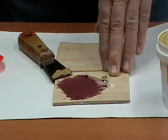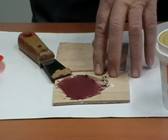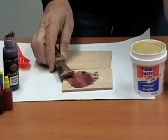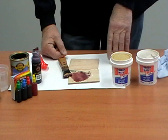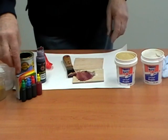There are two ways I can work with this. I've made a putty that's equal in colour, which I can now compare to the product and use straight away as a filler. I could also use the same natural putty, fill the gap, let it dry, and then put a stain over it and I'll get an even colour. So I've used a bit of spirit and a bit of water — I can now use a bit of food colourant.